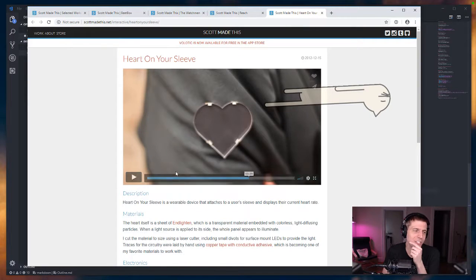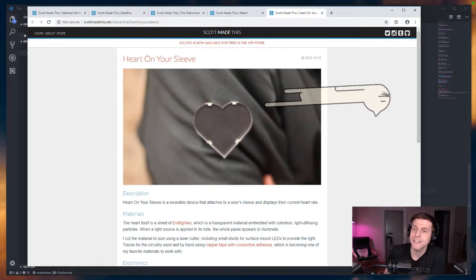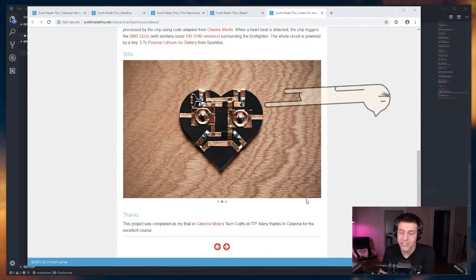If this stopped blinking, it was so bad. So the way you make a heart rate monitor, or at least the easy way to make it, is that you just have an IR emitter and an IR sensor, and you just shine IR into your finger, and then you watch for it to bounce back. And every time your heart beats, some blood flows out to all the capillaries, and the internal reflectivity of your body changes, and you can sense those variations and figure out a heart rate from it. My circuit was bad, and so it very frequently looked like I didn't have a pulse.